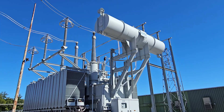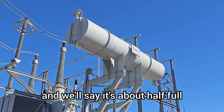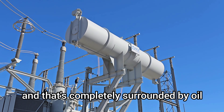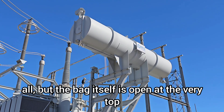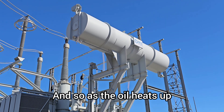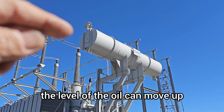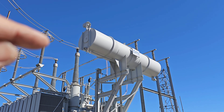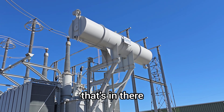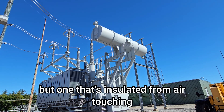This tank up top is like a giant holding tank — about half full. There's a plastic bag inside it that's completely surrounded by oil. Air can go in and out of that bag, so as the oil heats up and cools down, the oil level can move up and down inside the conservator without being exposed to atmosphere. It's kind of like a radiator tank, but insulated from air by that big thick plastic bag inside.